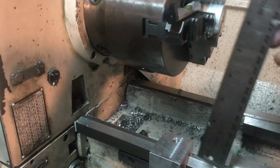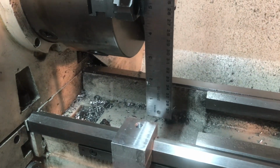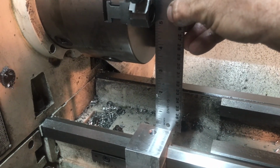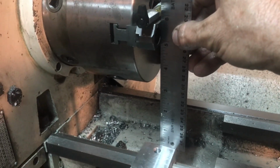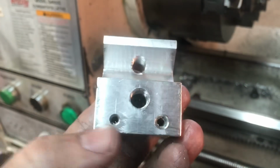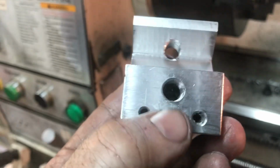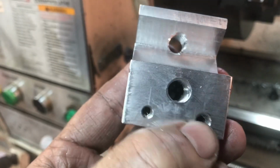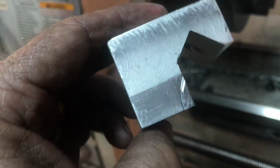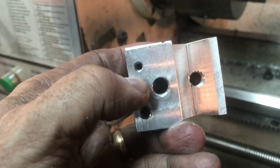Of course, for you, it would all depend on how big your block is and so forth. But 4 7/8 would be a good starting place for me for a nice adjustable stand that can get clamped on there. And on the bottom, I've machined, drilled and tapped a 3/8-16 hole that'll be for the clamp, and then I've got two 8-32 holes that I've drilled and tapped here for basically just stabilizing pieces that will keep my clamping plate on the bottom in place.